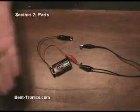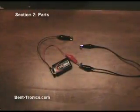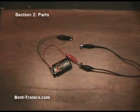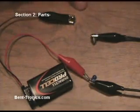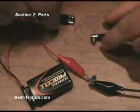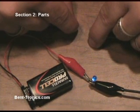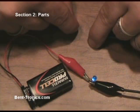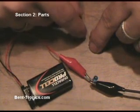Now I'm going to talk about body contacts. For this demonstration, I'm using a brass spike — just a piece of conductive metal — using the battery and a blue LED. I have two spikes hooked up to the alligator clips. Basically, instead of the electricity flowing between the two points directly, I'm going to grab one with one hand and one with the other, and you'll see the LED turns on. The electricity is actually flowing through one hand, through my arms, down to the other hand, making the connection. There is no sensation of shock — I don't feel a thing because the current is so low. When I let go, the LED goes out. So that's all body contact is: connecting two points with your hands.